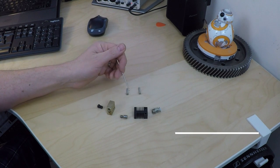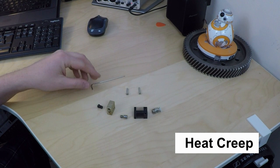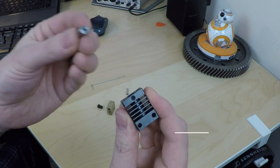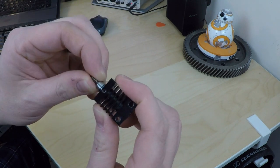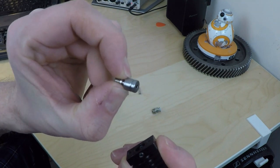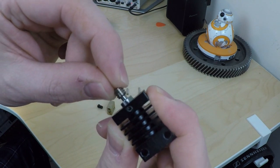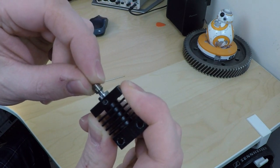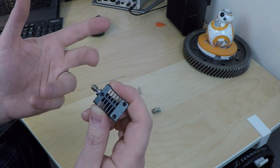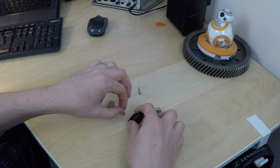So with the hotend in bits you can see all the pieces: the nozzle, the heater block, the heat break, the cooler, and the coupler. The key thing for me — this cooler is supposed to keep the heat break cool, keep this end cool. But you can see there's just not much contact — maybe six or seven mil of interaction — and if you look at the fit, it's just floating around in there. It's like a mini drive down the Channel Tunnel. It's just the perils of buying a clone — it's going to be no good for heat transfer at all.